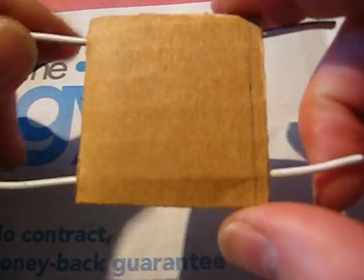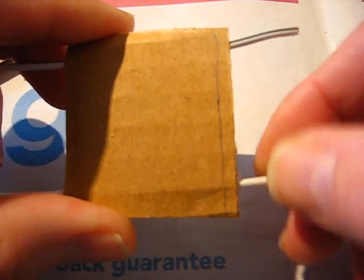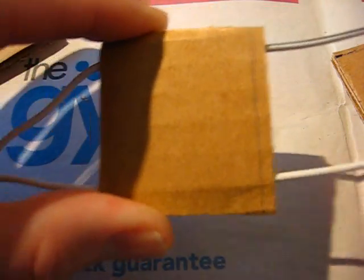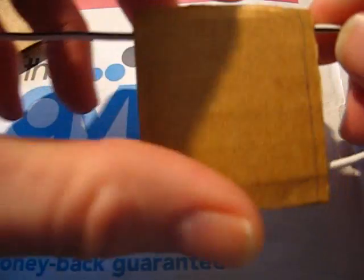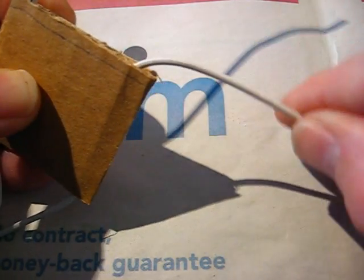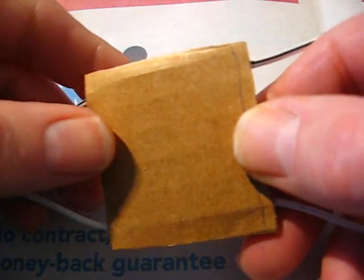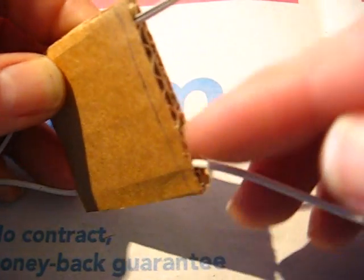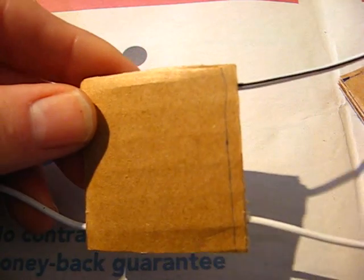As you can see, these are the small pieces we've cut from this cardboard and these are going to be our spacers. We're going to take this to the first 41 inches, keep splitting the wire as we go down, and this will be our first element at the top — 41 inches each. These will be super-glued in first and set before we do the other spacers.